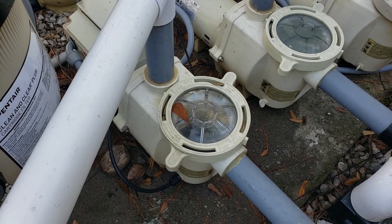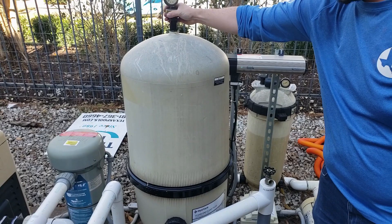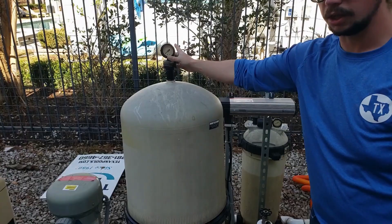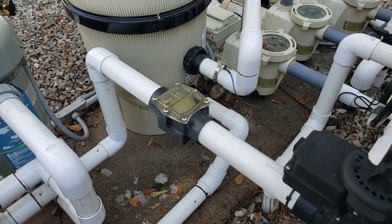It gets mostly cold. We'll need to release some air from the pressure system up here on our air bleed. Once water starts coming out, we can close it. Now we're just going to do a visual inspection for any leaks after we're done. Everything is looking pretty good — nothing from the unions, nothing from the drain plugs. Take a look around the belly band.